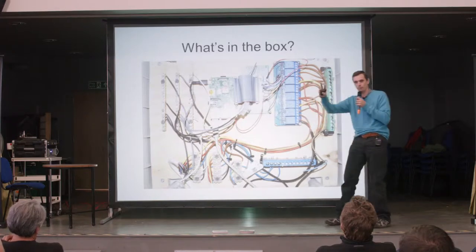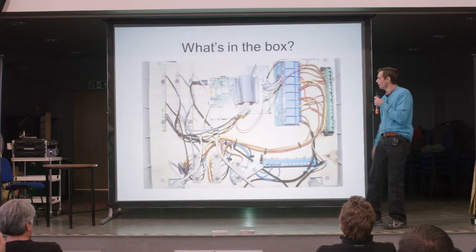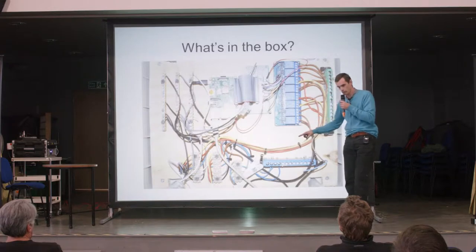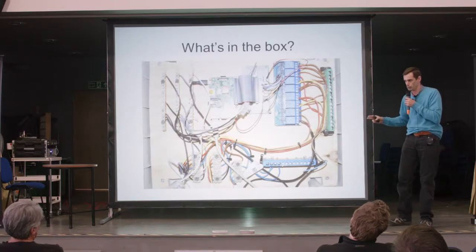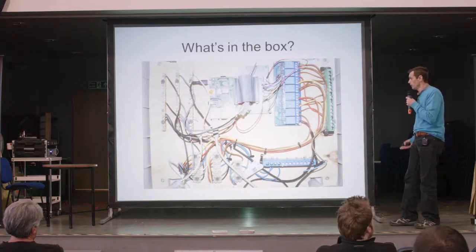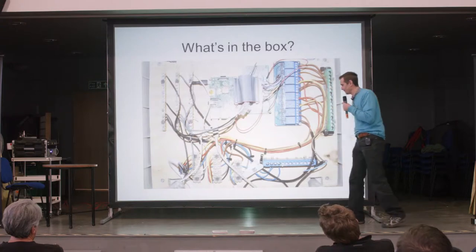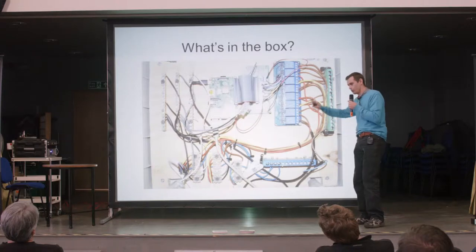That's the point at which you could be easily pairing two pins together, back-feeding, and blow your Pi. I got away with it, but so be careful. The only bit of this that doesn't run 240 volt is the boiler connector, because all you're doing is closing a switch — as far as I'm aware — on the majority of boilers. It might be worth checking if you are installing your own system whether that's actually the case. The OpenTRV guys said a couple of years ago they might actually blow up a boiler, so I was quite keen not to do that, but having already installed my own boiler I knew it was just a question of closing the switch.